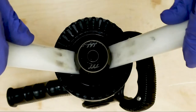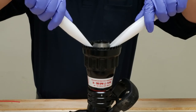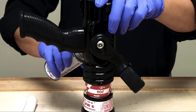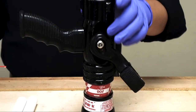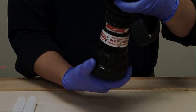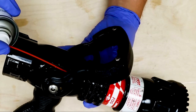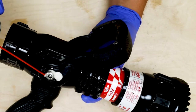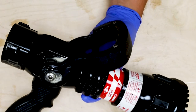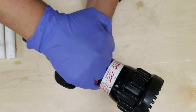Then, using your check sticks or wedges, work the baffle up and down a few times to get the lubricant into the moving components. With the nozzle back in the straight stream pattern, apply a few small squirts of lubricant behind the shaper and again rotate it back and forth working the lubricant in. Moving back along the nozzle, apply a couple small squirts on top of the detent balls and springs, as well as a small amount on the valve discs on the bottom of the nozzle where the bale handle attaches to the nozzle body. Work the bale back and forth to help work the lubrication in.